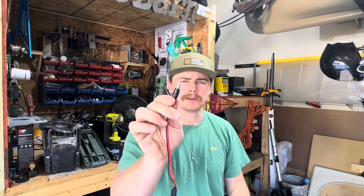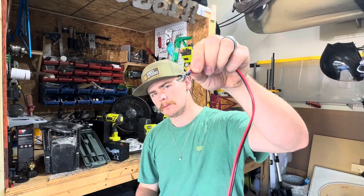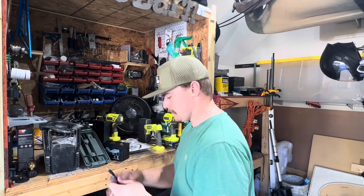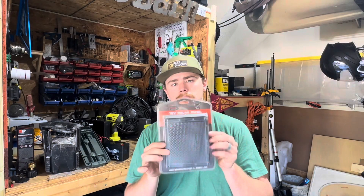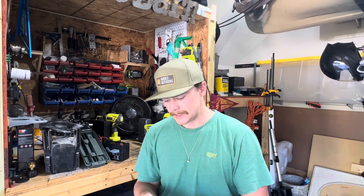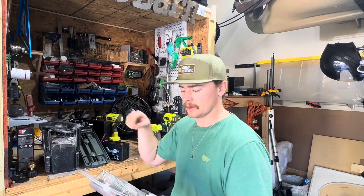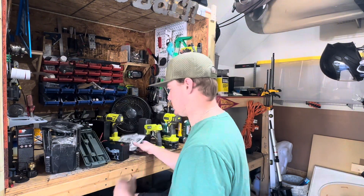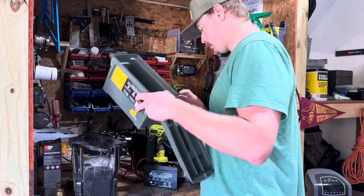I'll put a link in the description for pre-made cables. I make my own cables - it's cheaper. You just buy these little 12-volt plugs that go into your camera and then your spade connectors - the female ones that click onto the battery. Pre-made cables will be in the description if you need them. You also need solar panels. I found that the Wild Game ones from Academy work really well because they have spade connectors with a two-way connector so you can plug the out cable directly into it without having to solder on a new spade connector.